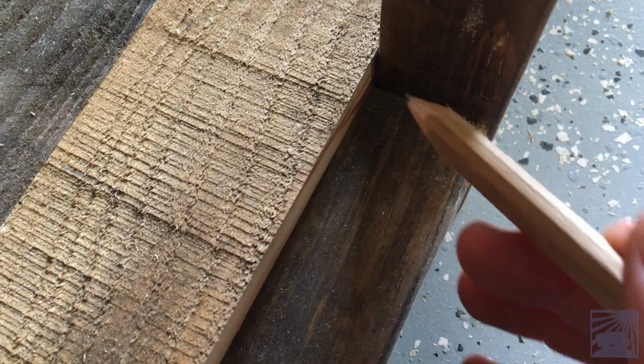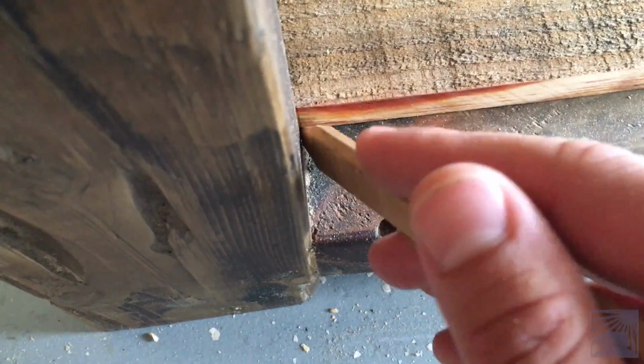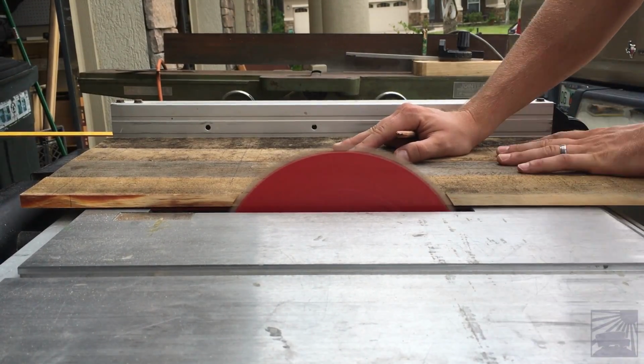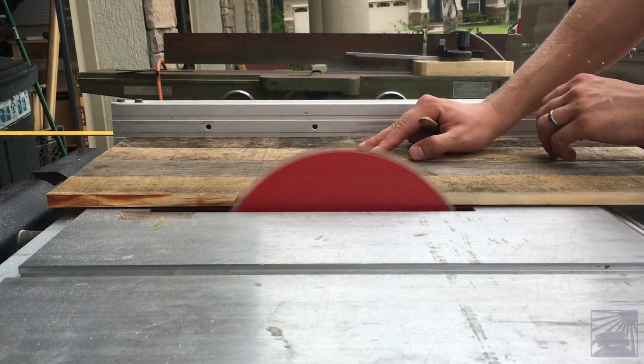In this case, one of my shelf's runners was just a bit wide in the frame and it stuck out into the opening. I determined the length of the cut with the shelf in place, then I eyeballed the thickness that needed to be sliced. I set the shelf panel over the table saw and raised the blade to cut out the material, thereby leaving the ends intact.